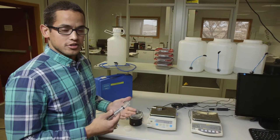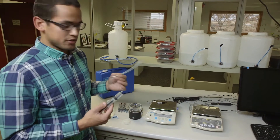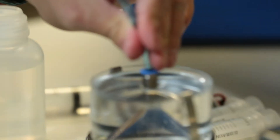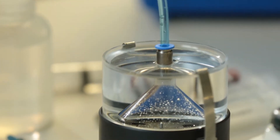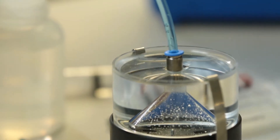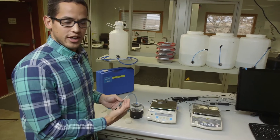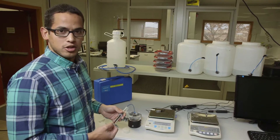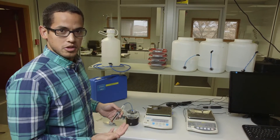Now that the water in the syringe is degassed, grab the tube used to attach the syringe to the acrylic adapter. Attach the tube to the syringe and attach it to the adapter, then pull the vacuum. One important caution: do not suddenly release the vacuum on the sensor base — whether from the syringe accidentally detaching or from releasing the vacuum quickly — as that can potentially damage the pressure transducers.